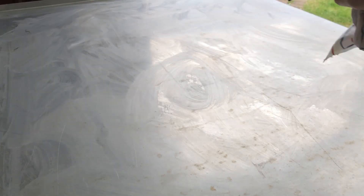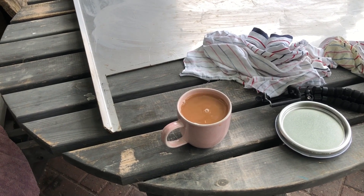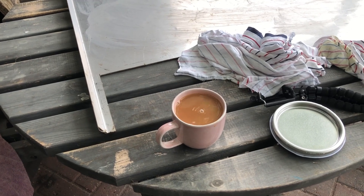I don't have to be so thorough and strict with this because it's not a proper mold with lots of curves, edges, square bits, and intricate sections — it's just a flat sheet. So all I've got to do is lay one sheet of 450 gram mat on this, let it go off, and half the time you can pop it off anyway. With this wax on it, that's going to be easy.